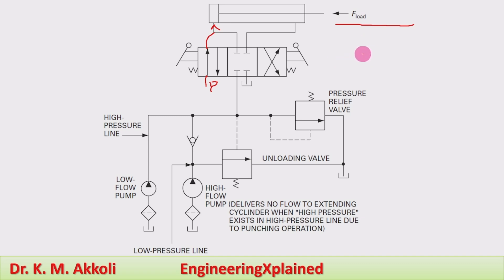If we used a single pump, it would need to be a variable high flow rate, high pressure pump, which would be costlier. To avoid that, we use two pumps. The low flow rate pump supplies the pressure needed to carry the load, and the high flow rate pump supplies higher fluid flow so the travel over that longer distance occurs at a higher speed.